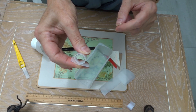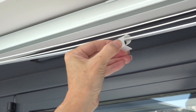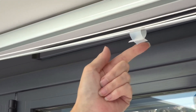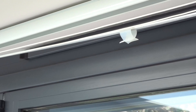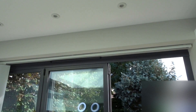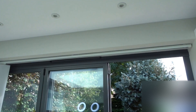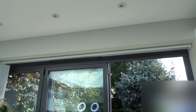I'm now going to put this on the rod and you can see how it works. I've inserted the slots one into the other and I've got it around the rod. All I have to do is push it up and sit this piece and that piece onto the shelf here and the shelf there. And there we have it - the little widget is fitted and the cords and the rod are pushed up and held firmly in the housing. I'm going to pull the curtains across and what should happen is that because it's floating effectively it should just go across with the curtains. And there you are - it does. It goes all the way across.